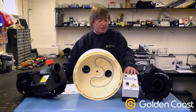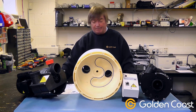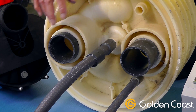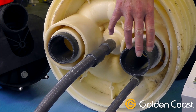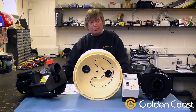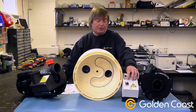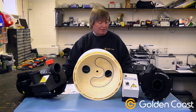It also comes with a motor starter like this one, and you can see the air pipe attachment on the front. On the back of the niche we have the suction and return pipework, an air inlet to let air in for mixing with the jets, and another conduit that carries the electrical cables and the pneumatic line back to the starter. Some of these starters have two air lines — one for the switch for the light and one for the switch for the pump.